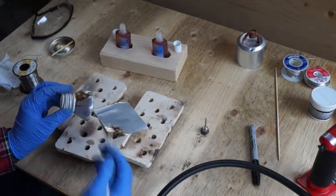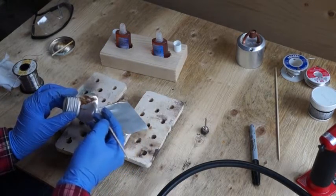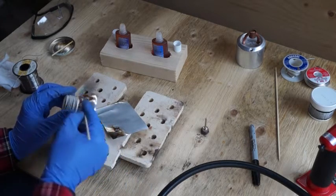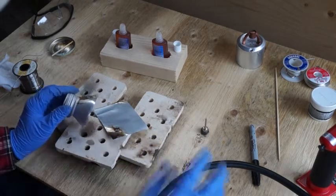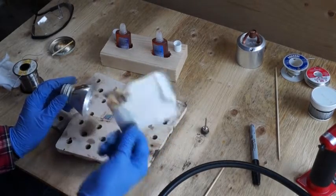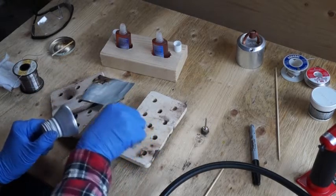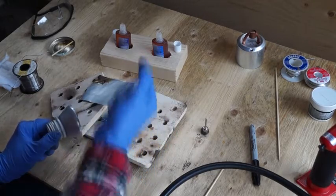It seems to be like four states: cold, bubbling, boiling, and then it starts to smoke. That smoking stage seems to be when the actual adhesion works. After that you get carbon or charcoal on it. Flat is fine and dished is fine, but before the adhesion happens the solder turns into a ball and rolls off. Same with the flux — it gets very viscous.